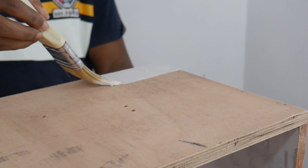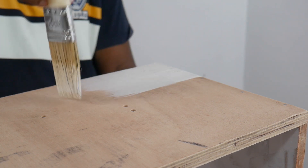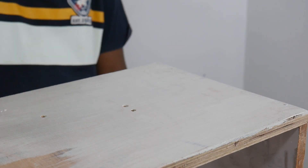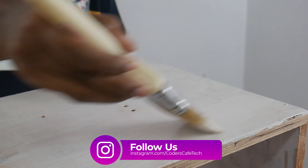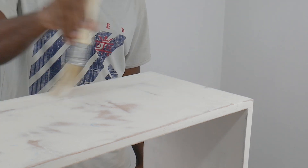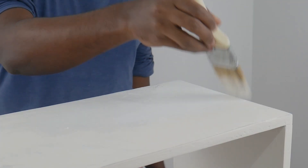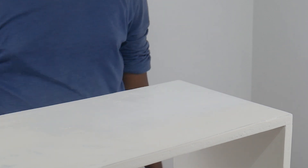Let's cover them up with a coat of paint. Firstly, prime the surfaces with two coats of normal wood primer, sanding well between each coat. Once it's done, apply a few coats of white satin finish paint for an elegant look.